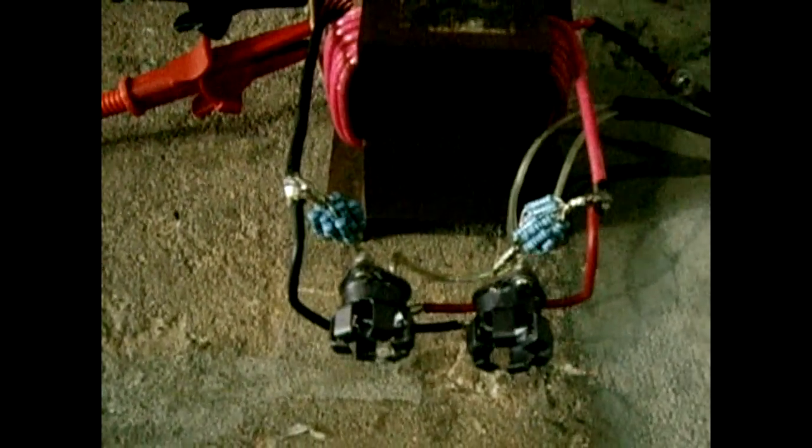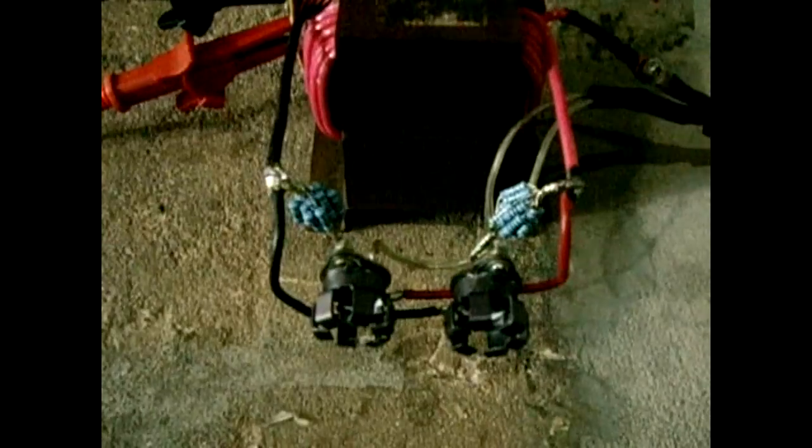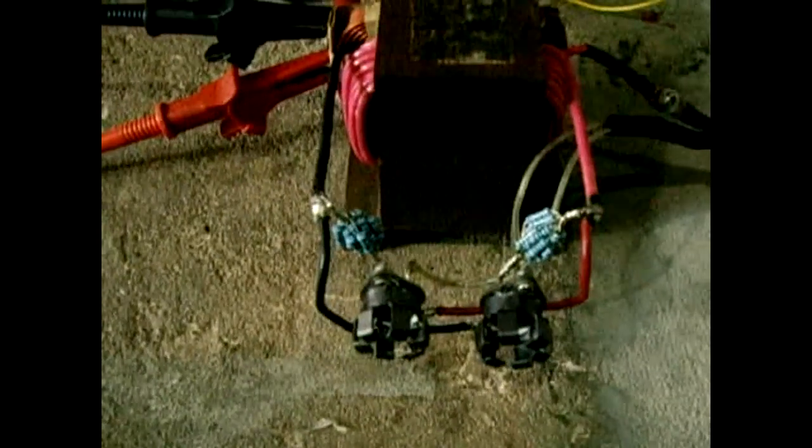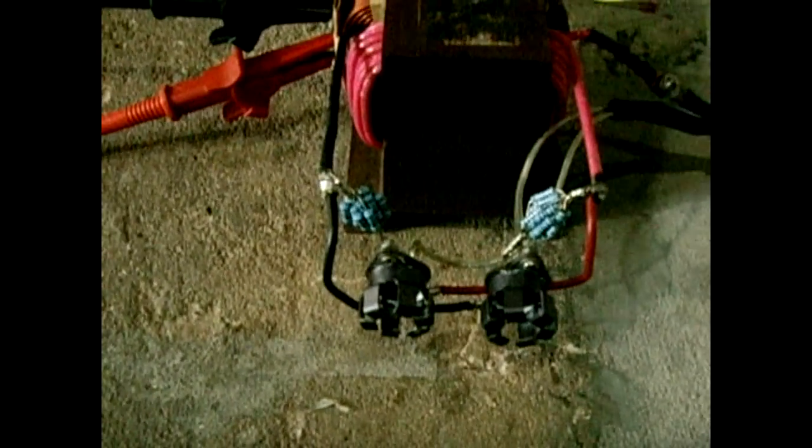This inverter will work for powering lights and many electronics since most go through a rectifier. Regarding the Aaron Cake design where people reported capacitors exploding: the easy fix is to use electrolytic aluminum capacitors rated 200 volts or higher. Even after that fix, that circuit still did not perform anywhere near as well as this one — this one performs extremely well.